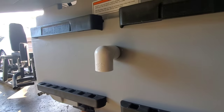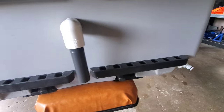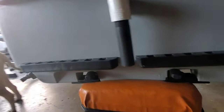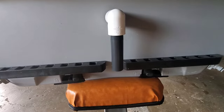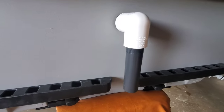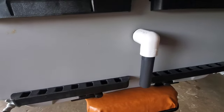So, I'll show you the finished product and I'm going to get ready to glue it all together. If you look back there, you can see the little rubber ring — this is the back part of it. You can also see the rubber ring. Once I tighten it up on the inside, it'll compress and seal. I think that's going to work just fine. At least I have a three-quarter inch drain now instead of a three-eighths inch. It's a live well, so I'm going to treat it like one.